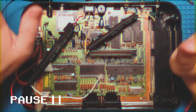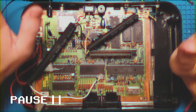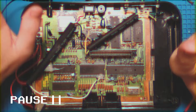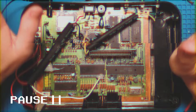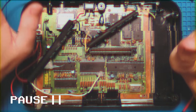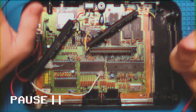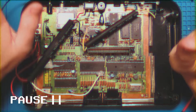Hey, it's editing Nick here. I just wanted to clarify - I realized while editing that that switch is actually illuminated. It's not switching between two sides, it's only switching on and off the right and middle posts. So that left red wire going to ground is kind of correct if the white wire was giving some voltage source. But because that pin on the VDP is lifted out of the PCB, it's never seeing anything but ground. So the LED would never work, and when the switch is turned off the pin on the VDP would actually just be floating - probably in an unknown state.